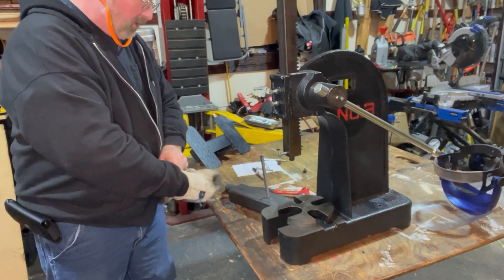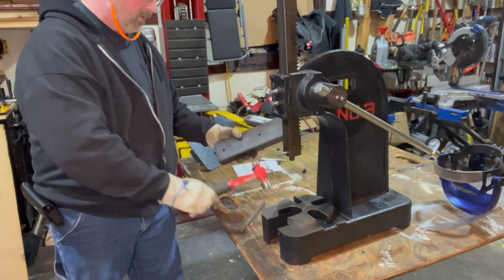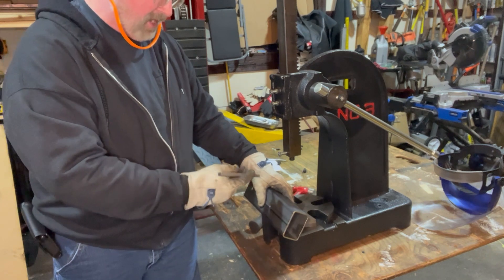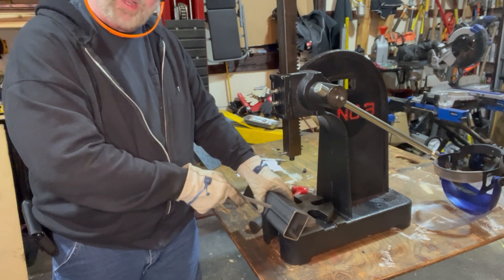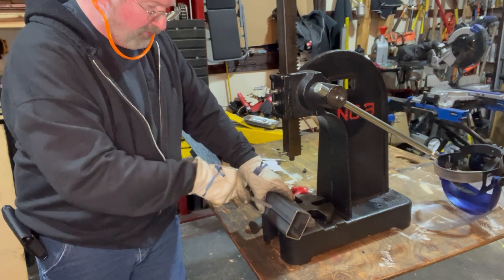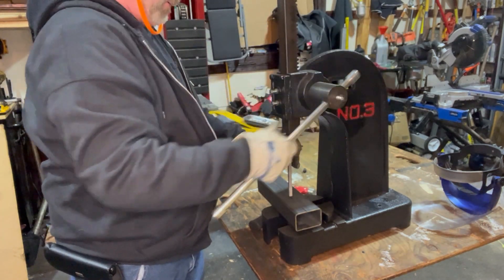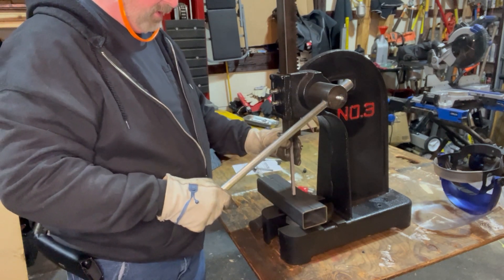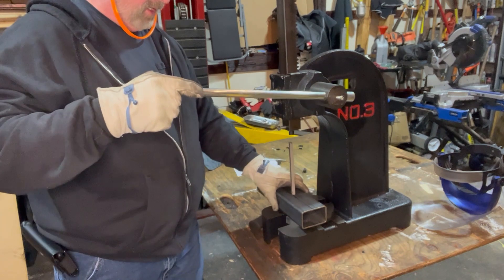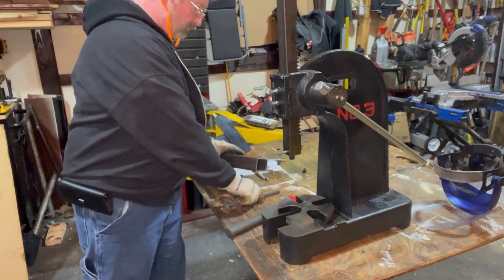Basically what we do here is I just take a hammer and push that through. Just work on this — if I had a heavier press I could probably push this all the way through, but I don't think I'd want to get to that point. Just work on squareness, a couple files, and then put it back onto the press. Safely line that up, push down, and you'll get a lot more movement. Then back through, push that out.